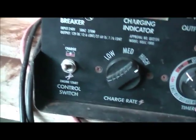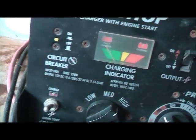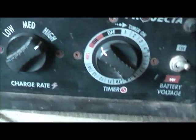Well, repair's going good. Because originally, when you first got this thing, he was using the whole transformer itself to jumpstart a battery from completely dead. It will not start an engine on its own. That transformer just hasn't got the power to do it. It's only to boost a weak battery. That's all that's for. So if the charger's got that and it's like this inside, no, it's not going to start an engine on its own. Not with a little circuit board and traces like that. Only to boost. Should be called boost, not engine start. Booster pack function, that's actually what it is.